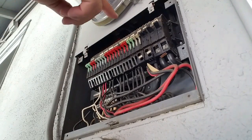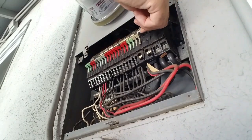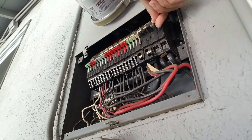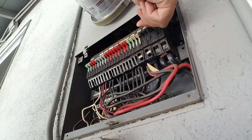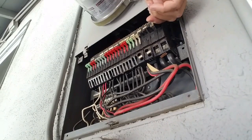So we're going to turn off the main breaker here. This shuts off all the power. This is a 125 amp — many times you'll see a 100 amp or a 200 amp. It's a two-pole breaker. The breaker could be up here sometimes, but in this case it's right here. It's going to shut everything down to make the whole panel safe.